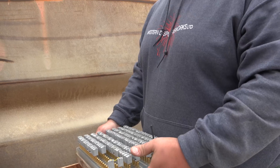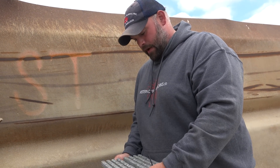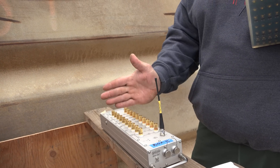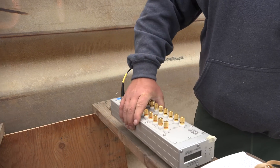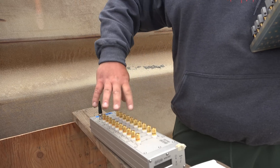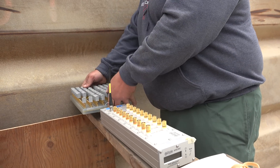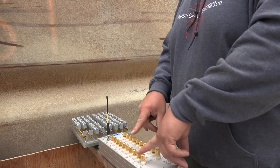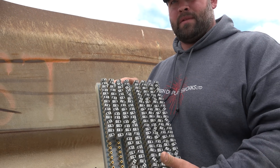These are really 10-shot blocks, but we turn them into 100-shot blocks with the matrix module. So you have your 10 outputs — 1 through 10 — and a separated ground. It goes 1, 2, 3... up to 10, then 11, 12, 13, 14, 15, and it keeps hitting by using the same ground but jumping the circuit. That corresponds with how the circuitry is done in the matrix module. That connection is made inside here — so number 1 is right there — and when you put that in, it knows to put the current exactly where it needs to be.